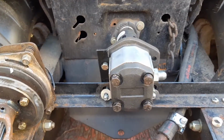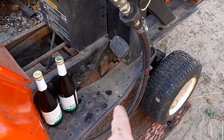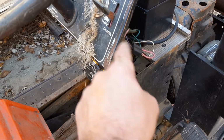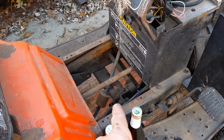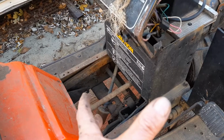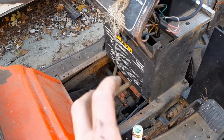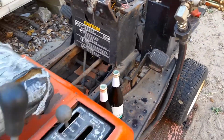The only thing I might do, I have a cylinder, I might try and put power steering. I'm still thinking about putting power steering on this little number, and I've got an orbital valve sitting in the wings to put on here. Because that's the original, it's a 4-port orbital valve, not a 5-port. That was originally what came with these tractors. On 1416s, they're an option, and then horsepower above that came with power steering, I believe. So I'm thinking about putting it on; it all depends on how hard it is to turn the wheels once I get the front end loader on. So anyway, I thought I'd give you this update.